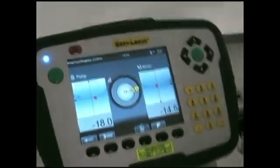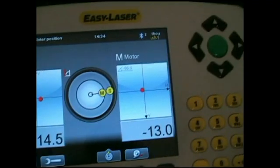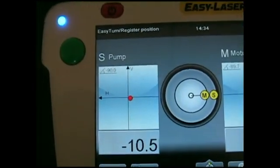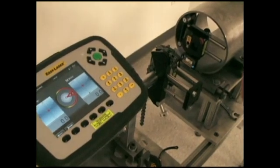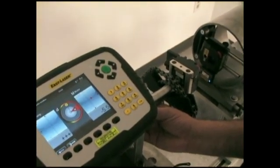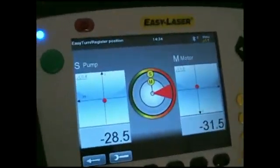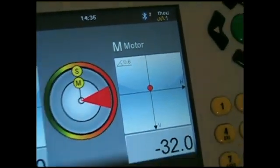As you can see, I have two live readings. What's important is that I get both inclinometers within a degree. I'm moving the M unit so that I read almost 90 degrees, and I'm moving the S unit also to 90 degrees. Now I can take my first reading. I'm using easy turn but I'll try to take a full sweep, coming up to 12 o'clock with the S unit. The inclinometer reads 0.4. I'll slide the M unit around so the inclinometer reads about 0.5 — that's close enough — and I take my second measurement.